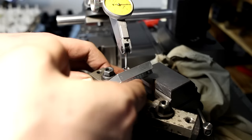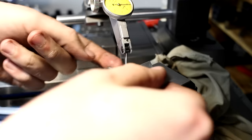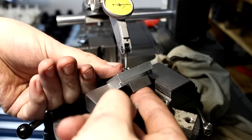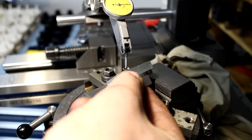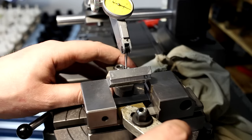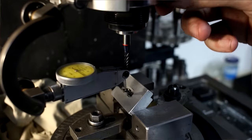And I'm using the back side of the fixture as a backstop. I take a gauge block, butt it up against the back side of the fixture, push the part in until I hit the gauge block. Then I know that I have my right depth setting. Should be reasonably repeatable. This is only a cosmetic radius, so we're not going completely crazy here.